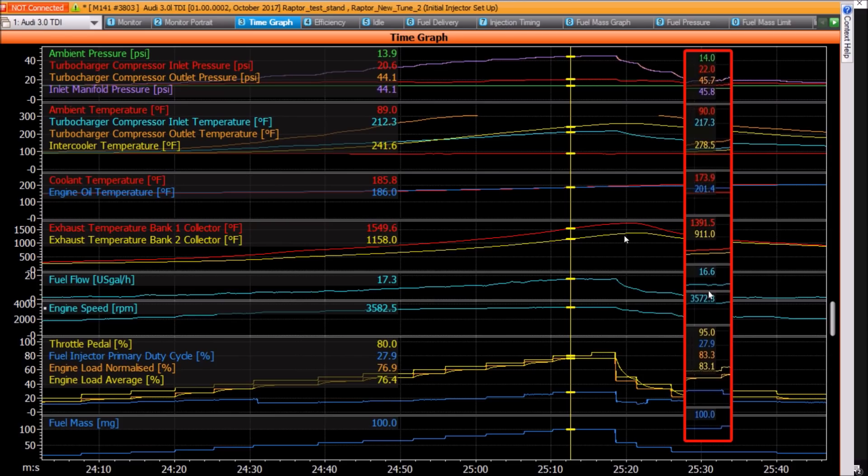That highest value right there we were something like 1700 on the EGTs — over 1700 EGT — which is kind of high and you don't really want to go there for very long. So I'm still just being careful when I run it up to the high power settings. But again, with the fuel flow being more, that turns into better horsepower, and we'll see how we go when we get a little bit more fuel mass on the next run.